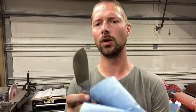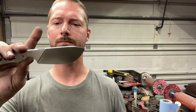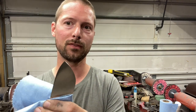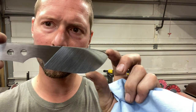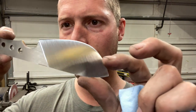This knife is stainless — it's 440C — which is a little easier to get a really nice clean finish on. When you're using high carbon steels and trying to do this, you'll end up with a little rust on your flats a lot of times, so I like to put a little axe wax on that flat part when grinding a high carbon steel knife. You can see that flat part is really clean, and all your grind lines are nice and even. This isn't a hand-sanded finish — it's just a really nice clean off-the-belt finish for a user knife that really works well.